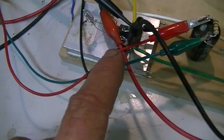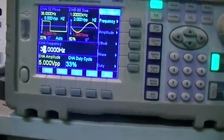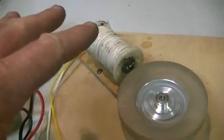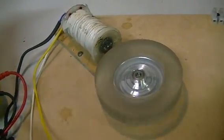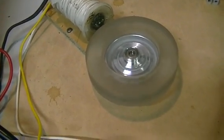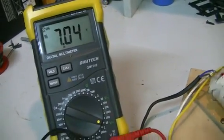The only difference is we have our trigger coil disconnected, and we are triggering our transistor — which is a TIP 3055 — from our signal generator at 35 Hz, 33% duty cycle. 35 Hz is our frequency on our coil. This is a very low frequency because I had to hand spin the rotor to get it to match up with the pulses so they're in phase. The rotor spins at that 35 Hz frequency. This is showing us the flyback power being dissipated across our resistor.